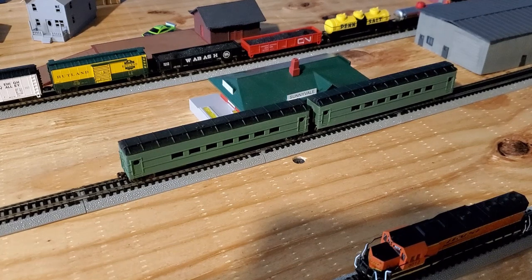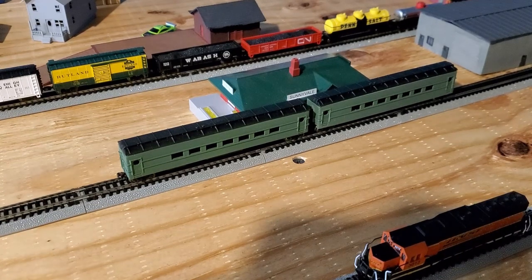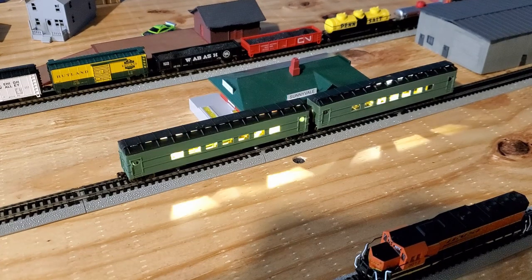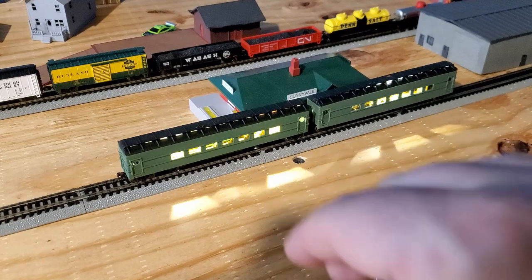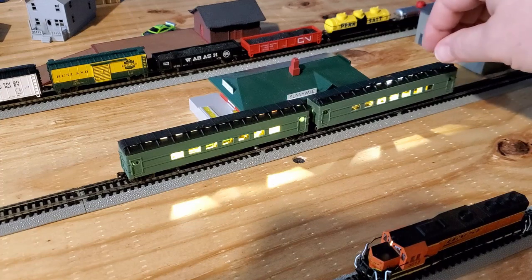When I turn the power on, you'll see it works just fine, but we'll see why I wanted to go the way I did. The one in the front has the extra capacitor and the bridge diode, and it has two micro LEDs in it. Let's turn the track power on and see what happens. We got lights! Now, aesthetics aside, the one in the back has only one LED and the one in the front has two — and of course the front one looks better. It probably could use a third.